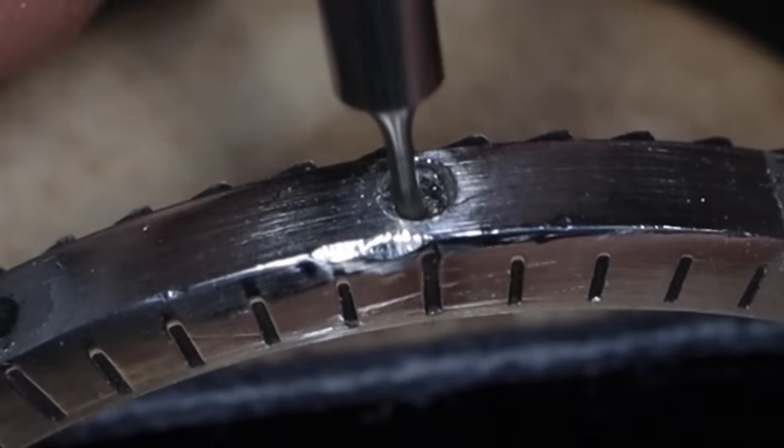D5 for the detent for the hour hammer, and also some 9501. Now you could apply the 9501 on the chronograph cam, but I'm applying it to the detent just so that I can tick it off on my technical sheet, as the technical sheet shows this point as the oiling point. D5 on the top and bottom operating lever posts.